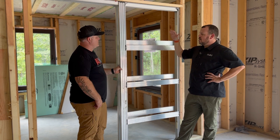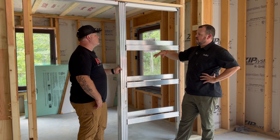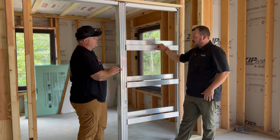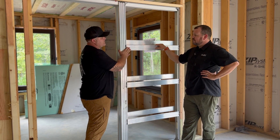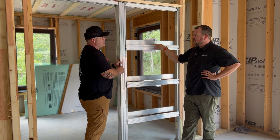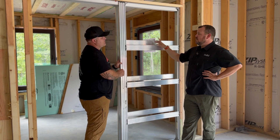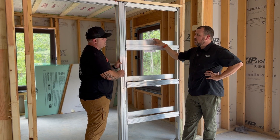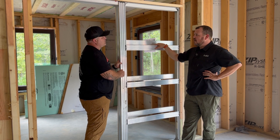The install is super important on the wood ones, but they're never going to be perfect and you're always going to be fiddling with them. It's a lot easier to make this straight and plumb. Being that it's aluminum, you still go drywall screws directly to this — the installation really isn't any different. You've got your casing and everything just going on. The big difference is rubber-malleting it all together and putting some screws in to get it the way you want. After that, it's pretty much exactly the same as any other pocket door hardware.